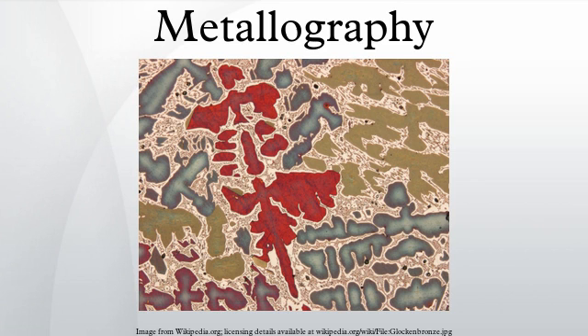If the crystal structure is non-cubic, the microstructure can be revealed without etching using crossed polarized light. Otherwise, the microstructural constituents of the specimen are revealed by using a suitable chemical or electrolytic etchant. Many different microscopy techniques are used in metallographic analysis. Prepared specimens should be examined with the unaided eye after etching to detect any visible areas that have responded to the etchant differently from the norm, as a guide to where microscopical examination should be employed. Light optical microscopy examination should always be performed prior to any electron metallographic technique, as these are more time consuming and the instruments are much more expensive.